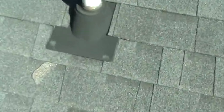All right, we're up on the main roof. A couple things to look at. These vent boots aren't that old. This is a $1 boot, cheap boot. It's actually about $4 now. One we use are about 20. We want the metal bases.